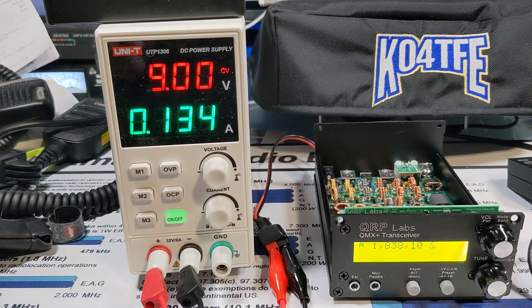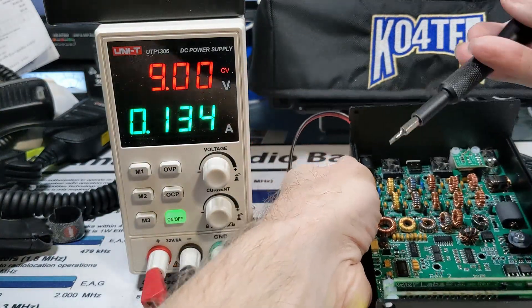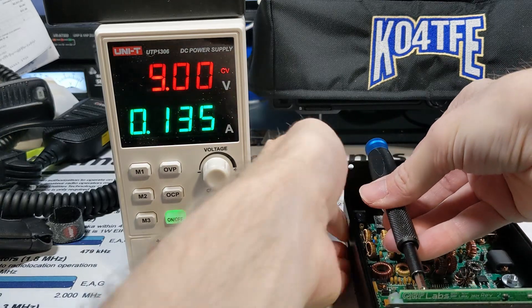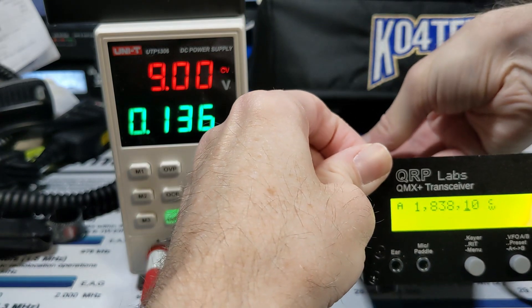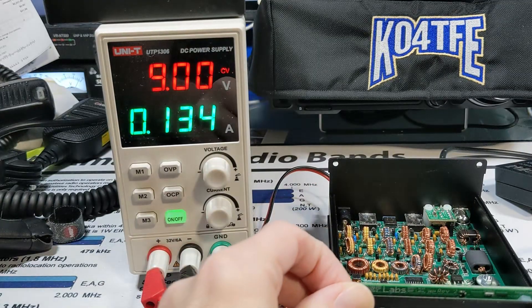Since this is metal, I'm going to be very careful here. I'm going to grab my little contrast adjustment and turn it down. I like to turn it up just until you start to see the blocks for the characters, and then turn it back down. I think that's pretty good right about there.